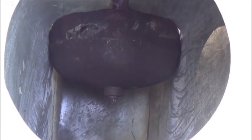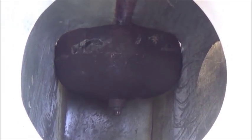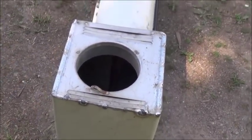We also have a chimney zone right here, and if I let the camera focus in for a moment, you'll notice the end of the pressure vessel sticking out into the actual firebox of the chimney. So as the fire from the rocket stove comes up the chimney, a good portion of it is going to run by the end of that pressure vessel, delivering a little bit more heat into the vessel before it leaves our output.